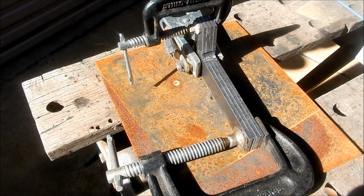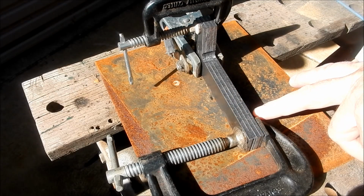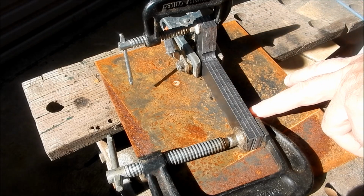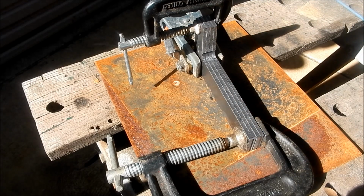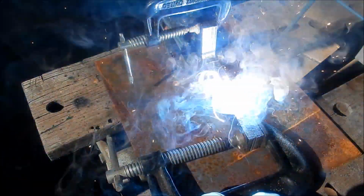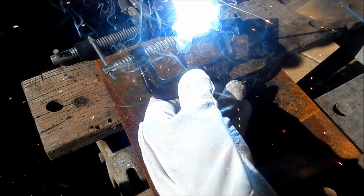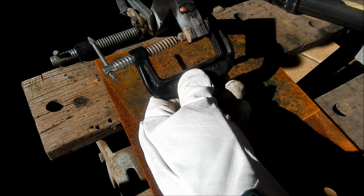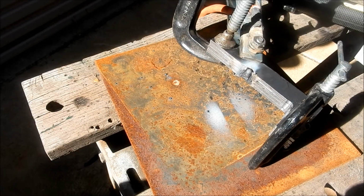Okay, guys, plan here is to just tack weld these together as a group, and I can do the drilling and reaming for all the support holes to put the support pins in. We can do all the OD machining, periphery machining as well as cut the radiuses on the end. When we've finished all that, we can then mill those spot tacks out. Righto, that's all we need.